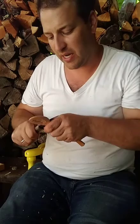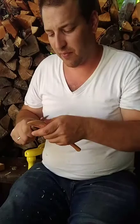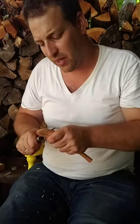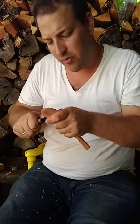Looking at this, I can see I've got a lot more weight on the center of the bowl than I really need. If you take a look at a metal eating spoon, I think you'll be shocked at how shallow it is. As long as the bowl is appropriately sized and fairly blunt-tipped, it will actually hold a surprising amount provided you cut it thin enough. You don't need it to be particularly deep-bellied.